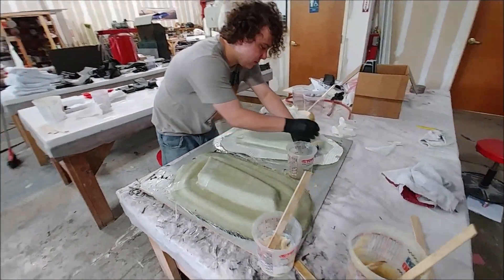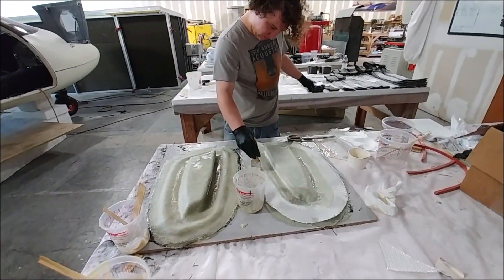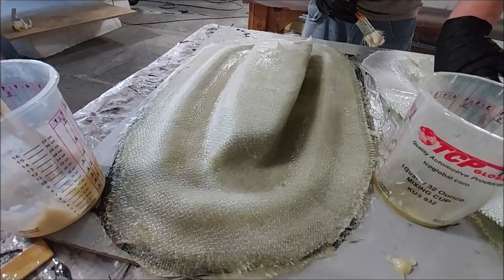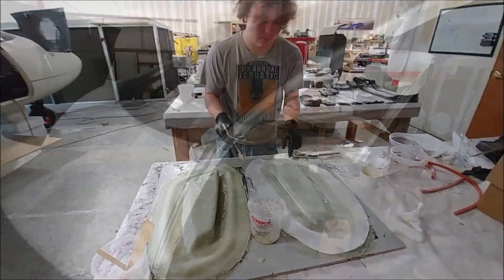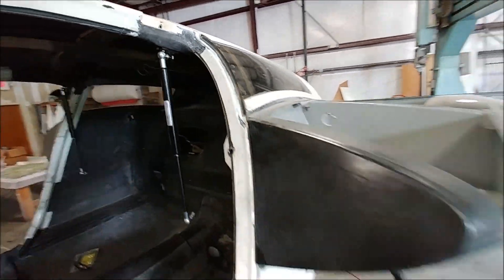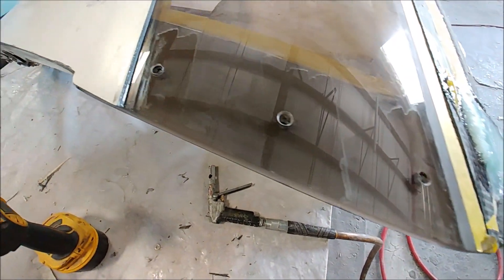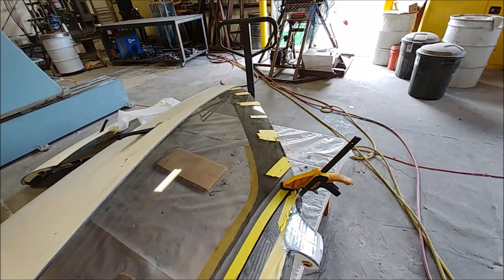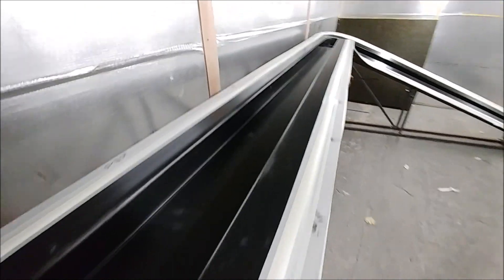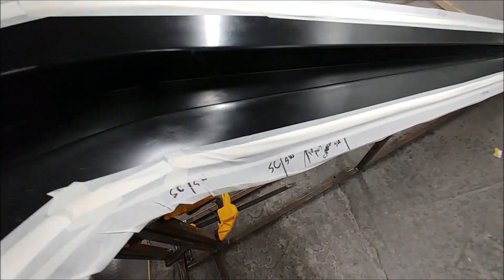Here's Devin laying up the heavyweight layers on those two molds — he's got one already done and is just finishing off the other, so those will just need to be trimmed and cleaned up. With each of these holes I start with a centering drill bit, drill a little bit, and before it starts getting really hot I take the drill bit out, put it in some water to cool off, blow it off with the air gun, and keep drilling. It takes several minutes just to drill each hole, then I transition to a normal bit through the carbon as well, and the countersinking takes about five minutes per hole.